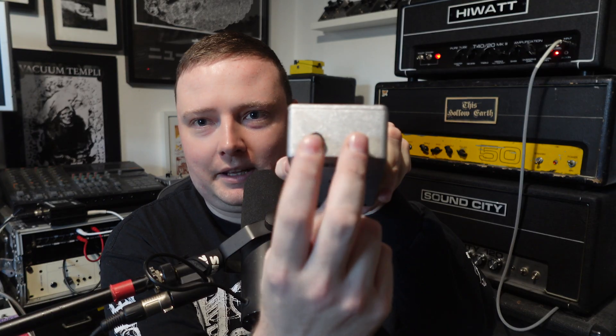This is very simple, it's powered by a 9 volt battery. It's an ever so slightly modified version of a schematic that is floating about on the net, which I will link in the description. The only difference between this and that schematic is that the schematic online is for a stereo device, whereas this one has both the left and the right output summed together. There's not much to this — you've got an on-off switch, which is literally just bringing a 9 volt battery in and out of the circuit.